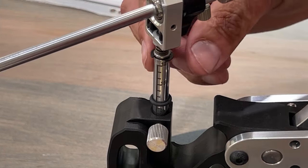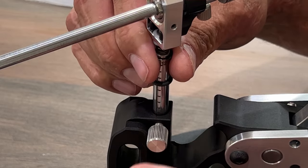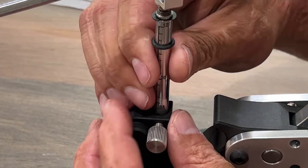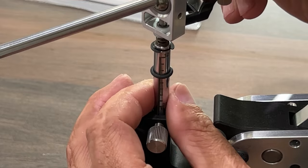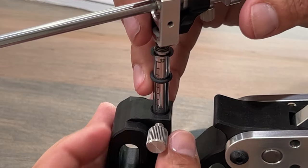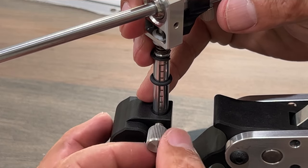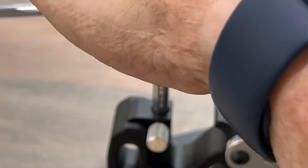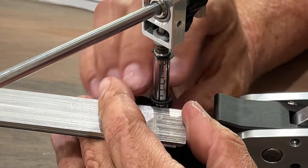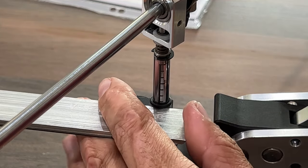This little guide rod has different angle adjustments on it and this is your stone thickness compensator. I don't love that compared to my Cadet Pro — that one has a little metal disc stop. It's pretty smooth going up and down and you have a pretty wide range; I think you can go from 12 up to 26 degrees. Of course if your blade is really wide that could change a little bit where the stone's touching the actual apex, but if you're worried about that you could always get the angle cube. I don't love the O-ring being the stone thickness compensator because it wants to pull back up unless it's making a full rotation, but you can get it done — it's just not the best setup.